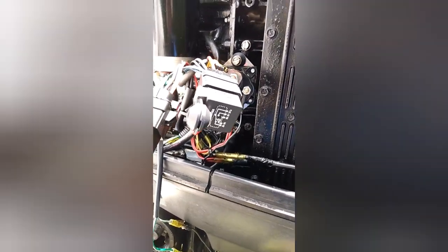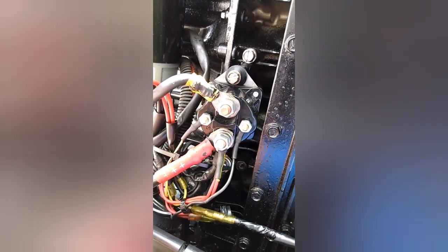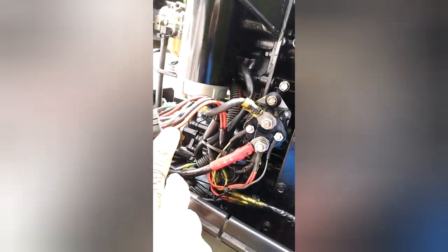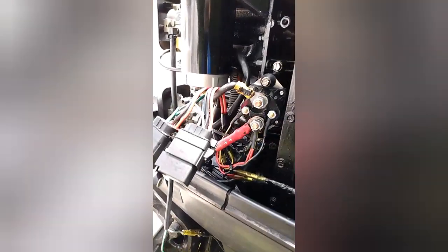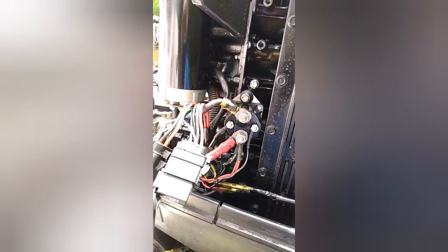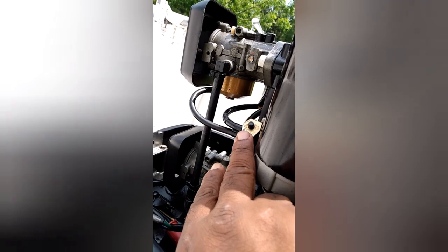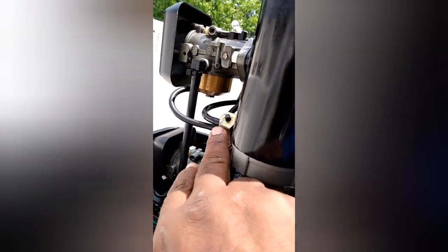Just hold the boat up and change out those bolts — four bolts right there. The red wire is hot and the black goes to the ground — the black goes to the bottom of the starter, and that's it. On these Force motors, if you've got one of the older two-strokes, there's a button right there that can reset the flow of gasoline going to your starter. Sometimes it'll be hard to start — just push that button one time to reset the fuel flow.